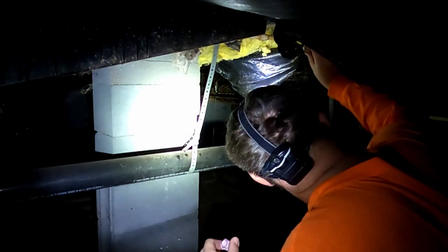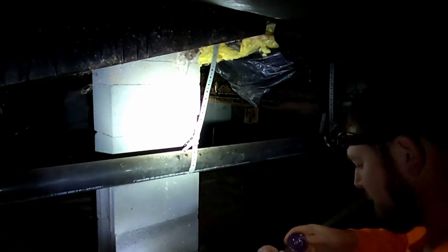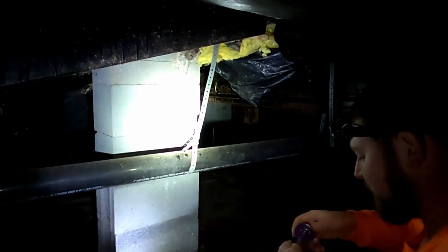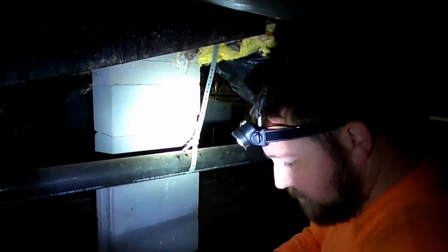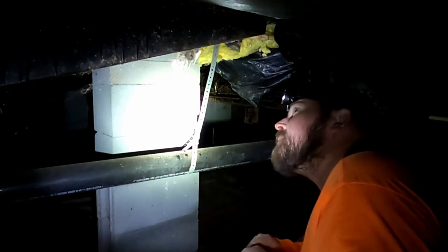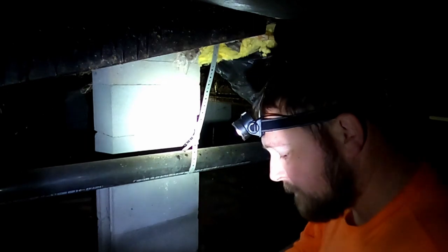So essentially the way it works, CPVC and cement, all that, is a chemical reaction that fuses the pipes together. So that's why you want to prime it and get it golden. I guess with FlowGuard, you really don't need it. Essentially, my thoughts, I'm going to put these on, twist them a quarter turn once the cement is on, and I'm going to Sharpie it so I know how much of a turn I need. So let me go ahead and...